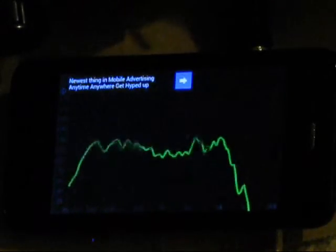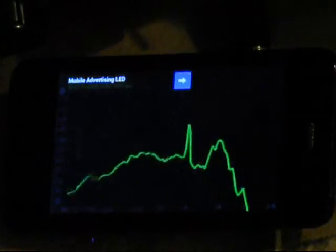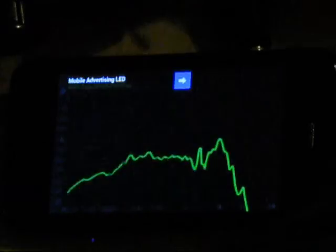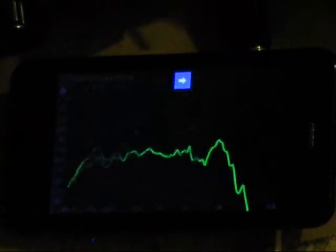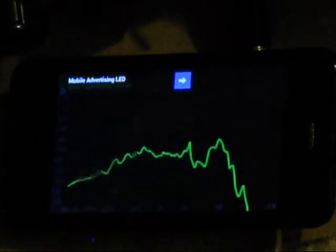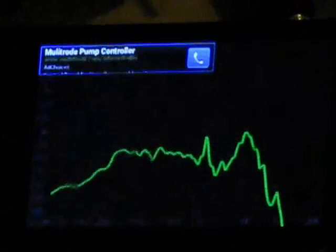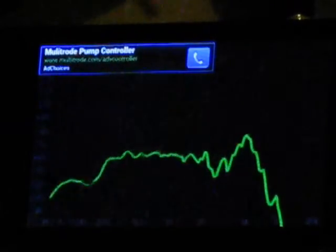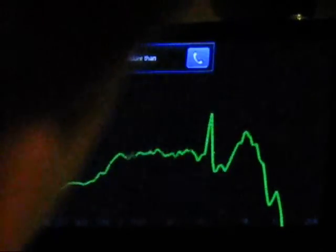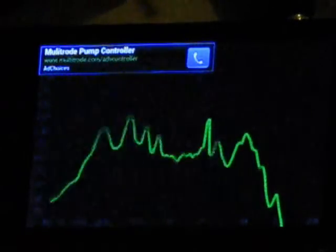So we'll try another frequency, like 2 kHz. At 3498 it's about minus 30, and at 3502 it's minus 50 — I haven't adjusted anything, and we're 20 dB down, so I'll just do some more twiddling. And it's down there nearly at minus 60. Back to the lower sideband and it's minus 30, so again a 30 dB rejection.